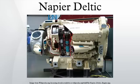The Culverin was an opposed piston two-stroke design. Instead of each cylinder having a single piston and being closed at one end with a cylinder head, the Jumo-based design used an elongated cylinder containing two pistons moving in opposite directions towards the center. This negates the need for a heavy cylinder head, as the opposing piston filled this role. On the downside, the layout required separate crankshafts on each end of the engine, and some form of gearing to take off power and combine it back into a single shaft.